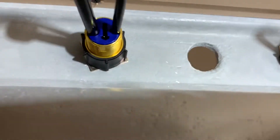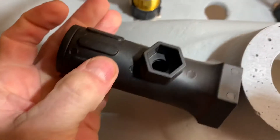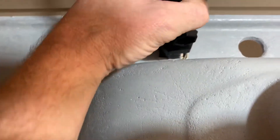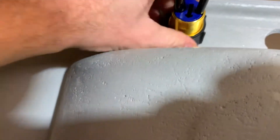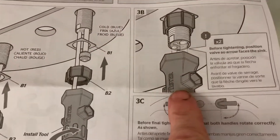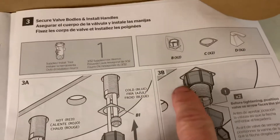Okay, the trick here is making sure the arrows, when these things are tight, face into the sink. I'm going to go ahead and put this tightening tool up over this. It's not bad, but it looks like it's spinning the whole thing. I'm not totally crazy about it. I'm going to put it with my hand and then tighten it down. I know the directions show using this tightening tool, but I'm not crazy about it for this application. I was able to get this nut here plenty tight with just my hands.